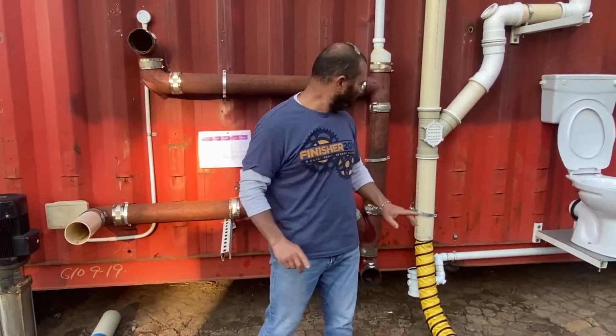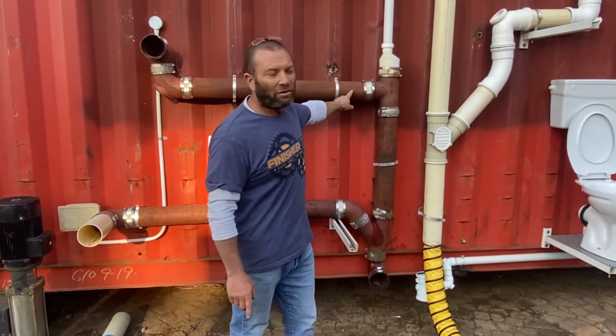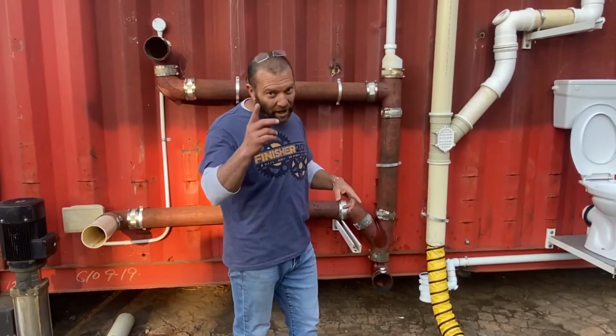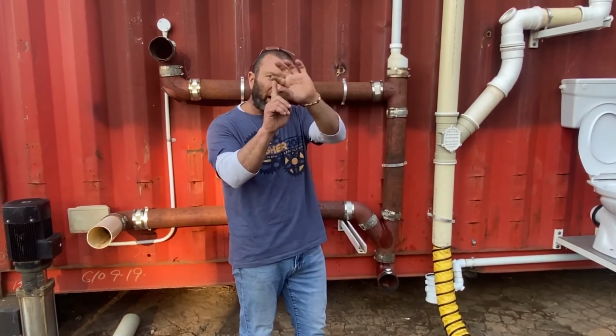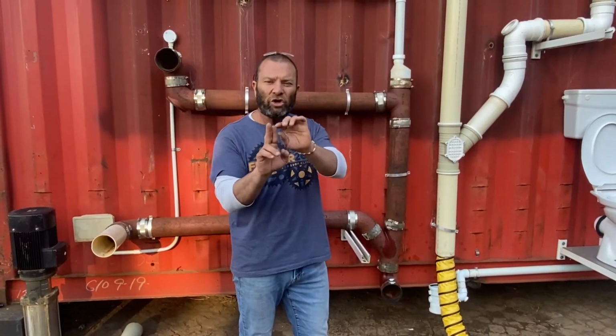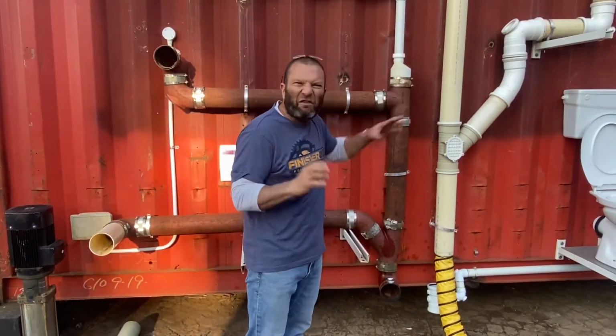Let's stay on the small diameter and then we'll move to the big bad boy. If I wanted to get a camera up here and around that 90-degree bend, the one way I could do it is you could tie a piece of fishing gut to the head of the camera, and then you can pull back and try and bend your camera. Or you can have what we call a lateral Y or a T probe, or you could use a tilt and pan camera, but a big heavy tilt and pan head is sometimes awkward to get around these small, very tight 90s.